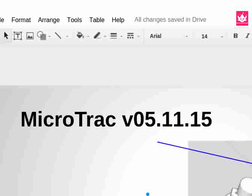So we make a bunch of these idlers. The more regular the idlers are, like if we could potentially make them all identical, the better. In terms of swarm production, it's easy. You just have the same part you're cranking out multiple times. So remount to basically a 1 7/8-inch shaft hole. Yeah, I think that could do it.